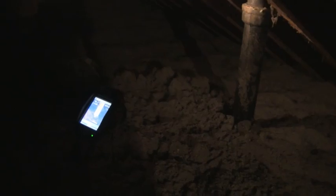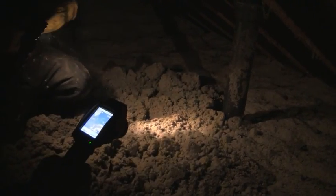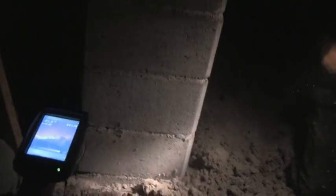We can switch over here to the plumbing stack. It doesn't seem like there's any warm air coming up around the plumbing stack. It's showing hot, but it's really only about 40 degrees above zero compared to everything else up here. It's showing there's a little bit of heat coming from around where the chimney and the ceiling sort of meet — about 50 degrees.